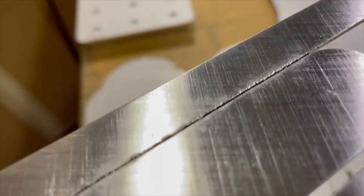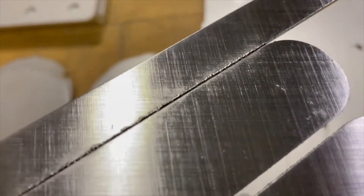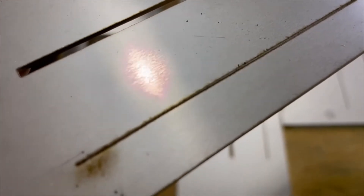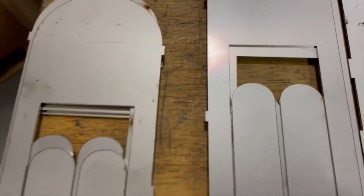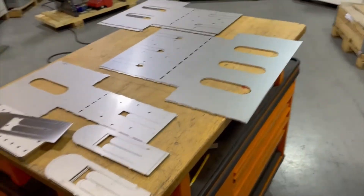On the burr side you can see that because this is in a narrow curve — not on the wider curve like you have in the center or on the right side where the cut is good — the brushes cannot remove this little bit of dross. So if you have a bad cut, and these pieces are nice and clean, you do not have that issue here, at least not very pronounced. This will clean up fine. It was just this pile where you would have to take a palm sander and palm sand just this section down to where it is flat and that dross is removed.